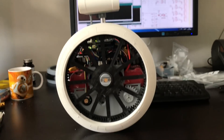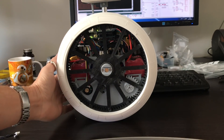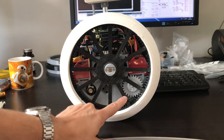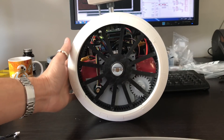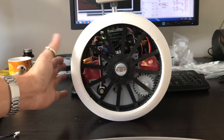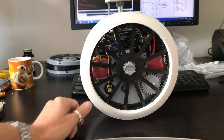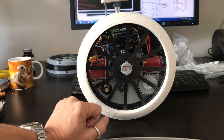I can show you why this is important — it's basically due to when Dio is stationary and trying to balance. You need very slight adjustments on the wheel, tiny movements, because at 30 RPM it'll suddenly get a jolt. It will stabilize, but it jolts along until you get past 30 RPM and don't get a nice smooth motion. Dio is powered up with his head in place. I'm going to tilt him forwards a bit and you'll see the motor try to catch up and bring him back to centre — but because of that minimum RPM it kicks in and you get that little jolt. Once you get to a certain speed the motion is fine, so that's why I want to get that minimum RPM down as low as possible.